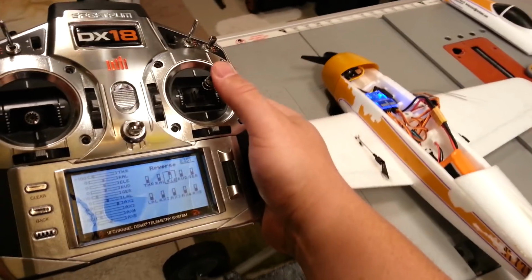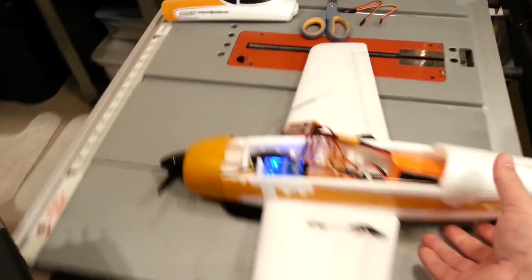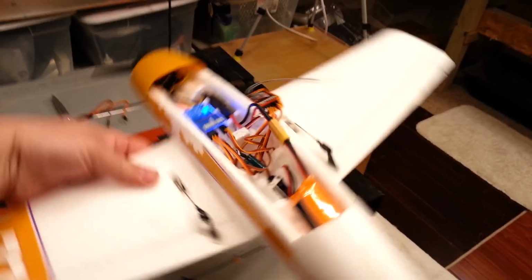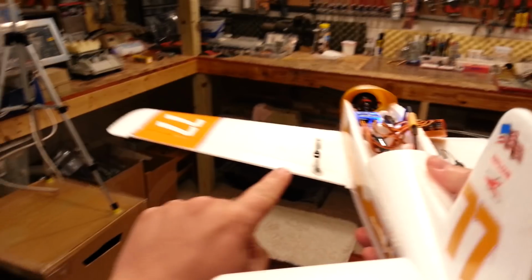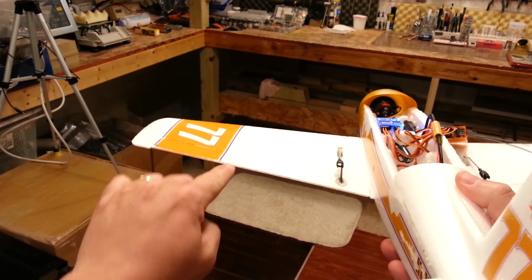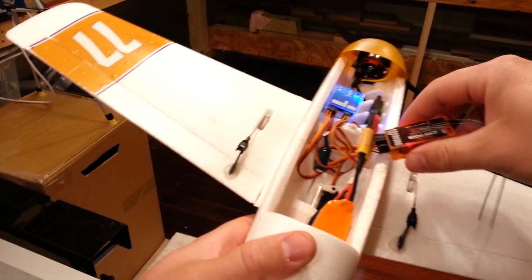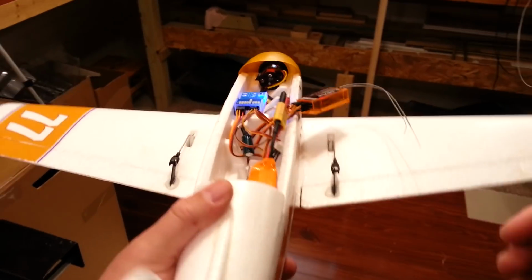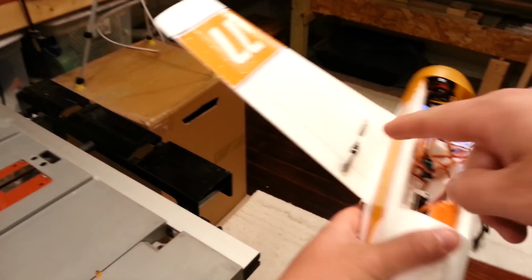So the next thing we need to do is ailerons. Ailerons. They're going the correct direction. Now let's see if we're going to correct in the same direction that we need to. Okay. We are correcting in the wrong direction, because as I move this wing up, this should go up to counter that. It's going with it. Now this one's not changing, you'll notice. That's because I don't know that I can support flaperons. I know I can't support flaperons the way I have it currently configured. So like there's nothing actually telling this aileron what to do, but this one's jockeying around.